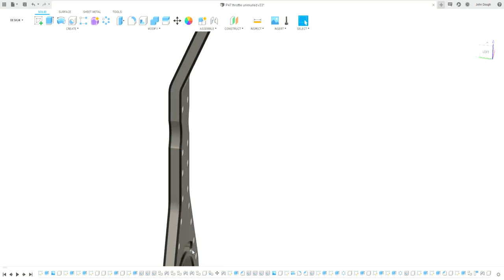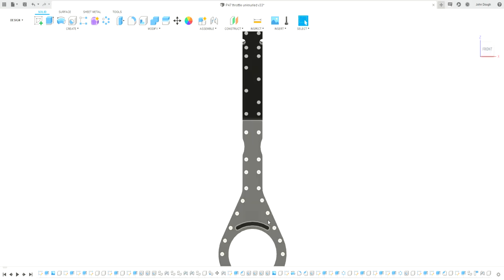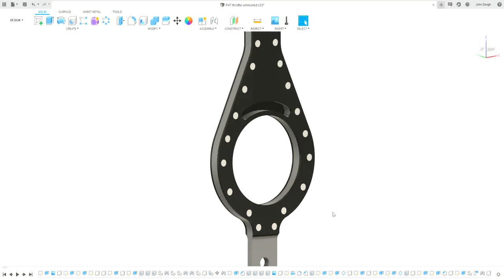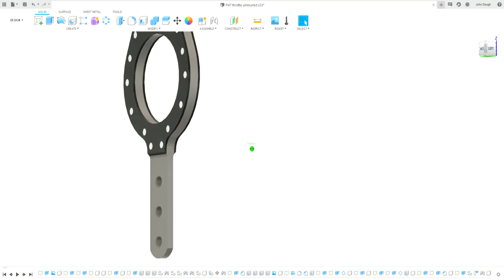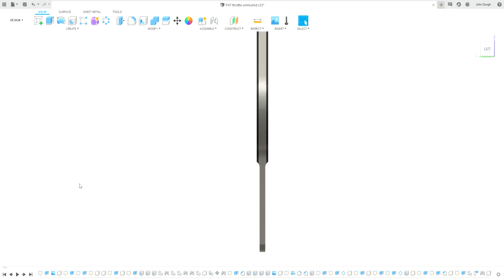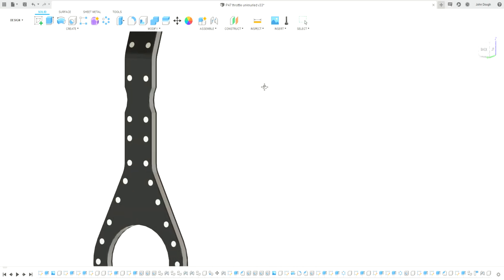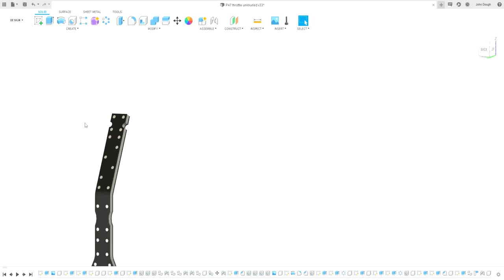There's a slot and a little insulated tube sitting between that slot and the aluminium piece where the wires come out to the plug — I couldn't find anywhere showing where the wires came out. They appear to travel internally, so there must be something like this. I found a picture of a smashed-up one showing a big wide tapered section. I've put lots of rivets in in a staggered pattern at the top, just aluminium rivets — dead soft, easy to rivet. This is four-mil plate, and the end needs to be machined down thinner. All these holes have to line up with the bends; luckily the CAD works that out.